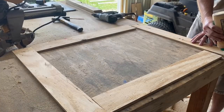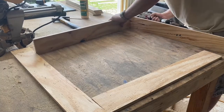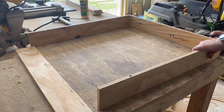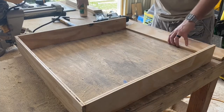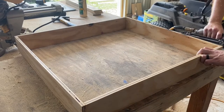After we've done a little sanding on all these boards, let's go ahead and start the assembly. I'll start the assembly process with these three and a half inch boards. I'm attaching these 26 inch boards with wood glue and some finishing nails flush with the top and bottom of those 25 inch pieces.